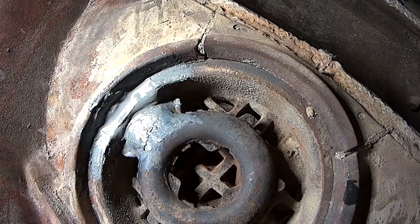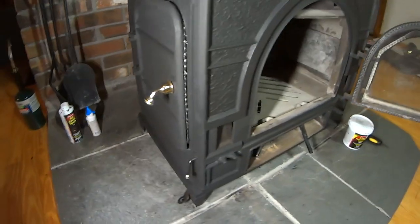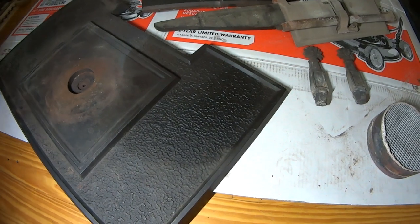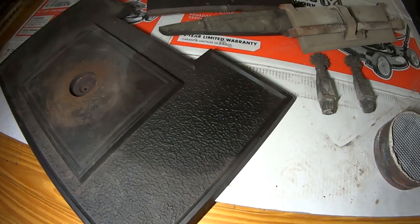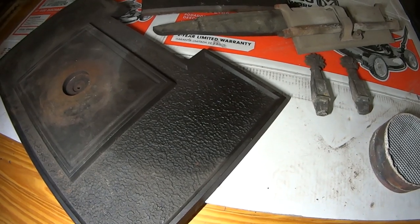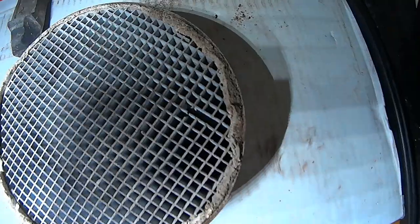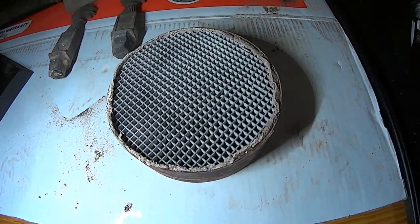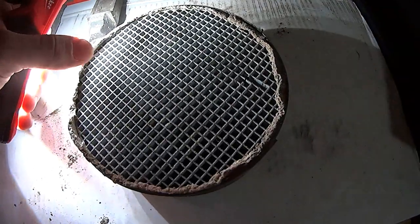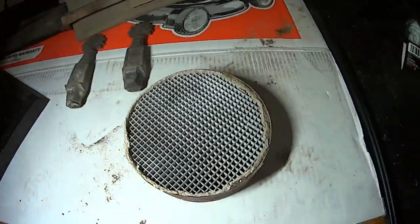Same thing up here — that's the catalyst hole. Getting closer, got the doors on it. Next step: you can see the oil I actually put on this because there was something rusty on top. I didn't want it to transfer over, so I had sprayed it with WD-40. Before I put this on the stove, I flipped it over and checked the gasket surface that gaskets the catalyst chamber, and I'm going to brake-clean this off. The catalyst has one crack in it — I think it will be alright. I'm going to blow it out lightly with low pressure air. There's also some K-wool material on top of it that's probably not going to make it back in, but I'm not too worried. Brake-clean this, blow it out with light pressure.